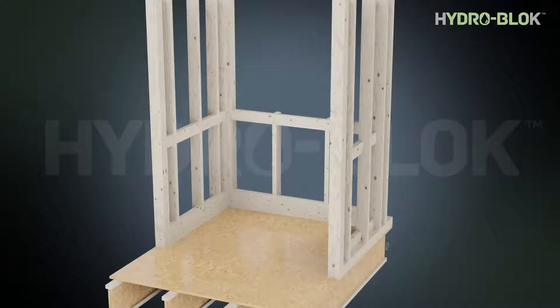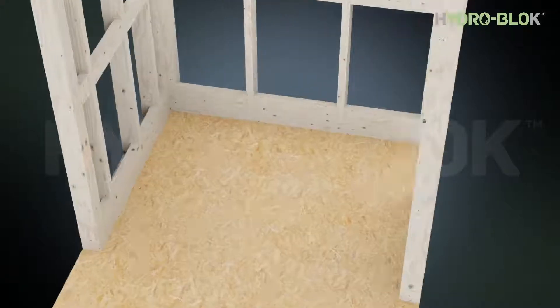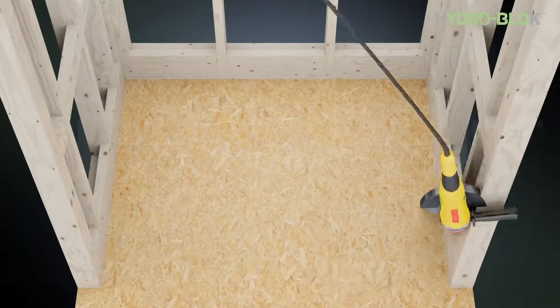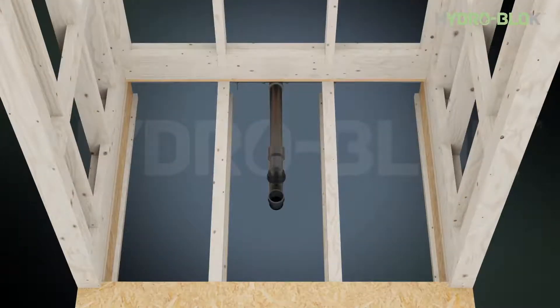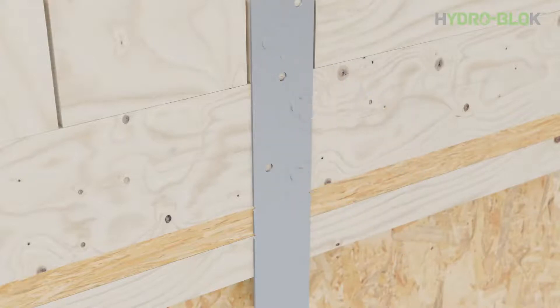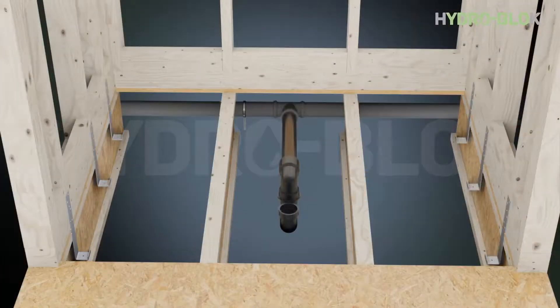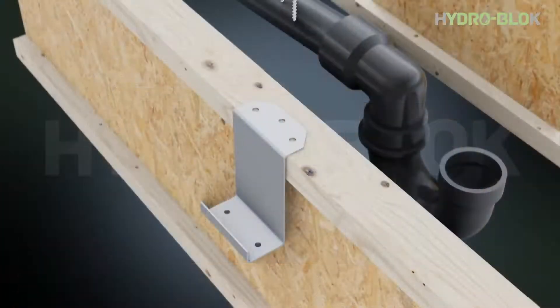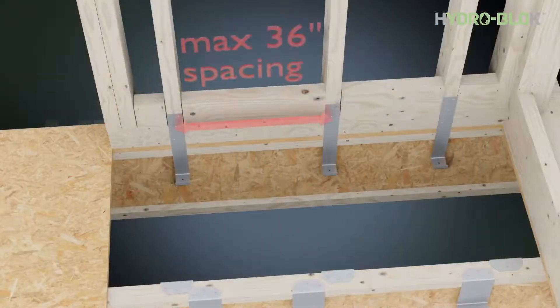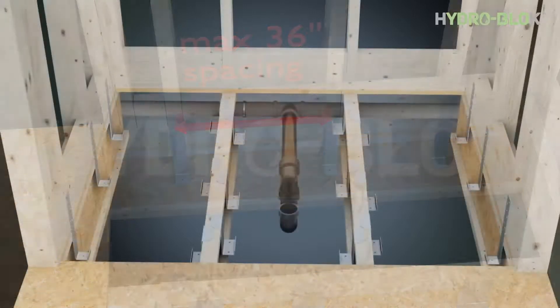Using the floor lowering kit allows you to recess the subfloor to sit flush with the top of your joists. Remove the entire subfloor to the walls and joists as needed. The subfloor should not overhang the joist bay or be left unsupported. Install the wall brackets using the included inch-and-a-half joist hanging nails. Refer to the instructions provided in the floor recess kit.